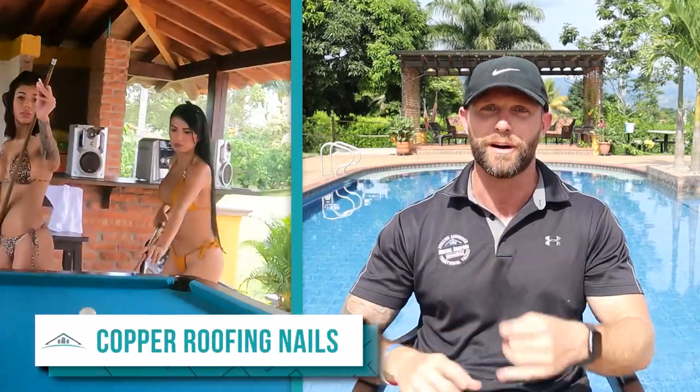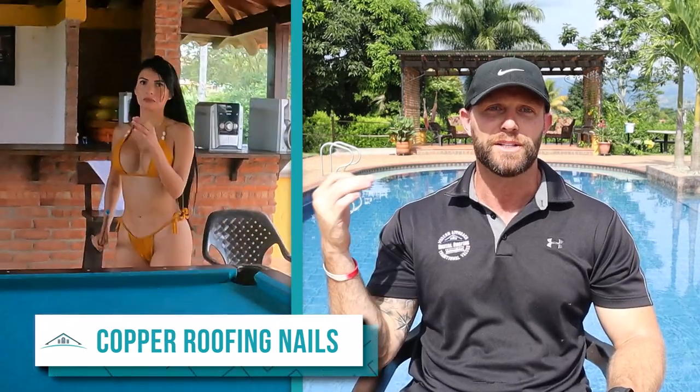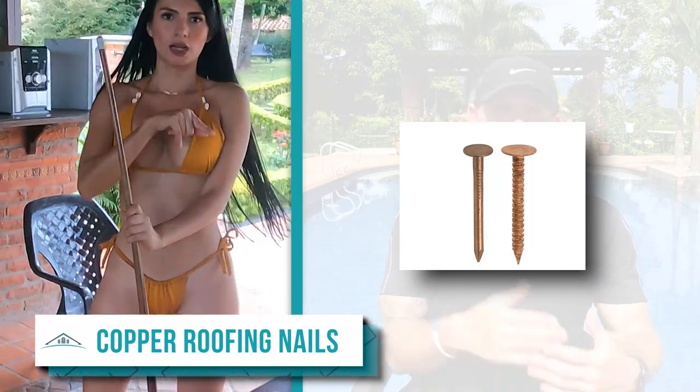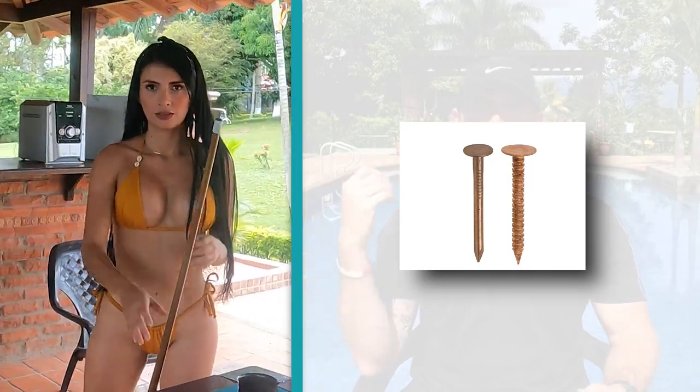So first is roofing copper nails. Roofing copper nails are the most expensive option by far, but they will last a lifetime. Due to their cost, we do not recommend using them for your typical asphalt shingle roof application or any type of roof that's going to last less than 30 years. Copper nails are best used when you are installing a lifetime roofing product such as clay, like our Spanish clay, slate, tile, or any type of copper roof. That's when you want to use copper nails.